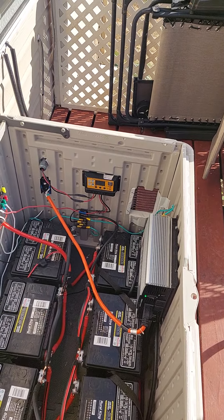It's made by the same company but it's a pure sine wave inverter. The difference between pure and modified sine wave: a pure sine wave has smooth electrical load patterns, while the modified is a square wave — it looks like building blocks. Sometimes you can have power spikes on those, and that's what causes stress, increased resistance, and higher temperatures on certain components, devices, and computer systems.